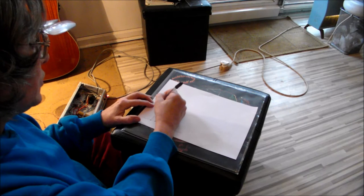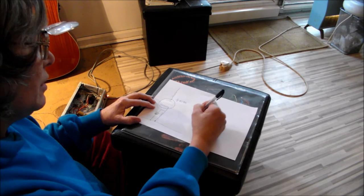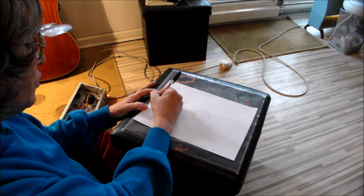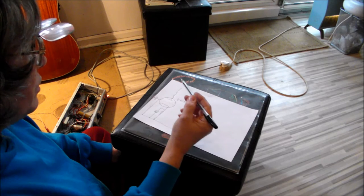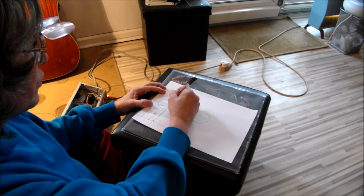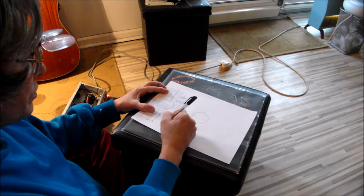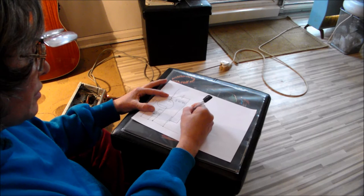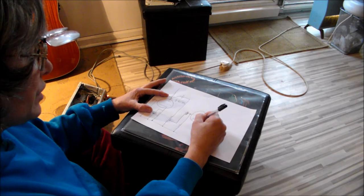Now, we've got the input there. This is half of an ECC83. The other half goes over there. This is a typical arrangement for this kind of amplifier. Then you've got a bias resistor there to hold the grid to ground, and then you've got a capacitor, and that's the input. The noise that's being created as the fault has got to be in this area, which is the first stage, because you've got the capacitor there, which goes into the top of the potentiometer. And then there's another capacitor, usually, and then a resistor to ground to hold the grid in at ground potential.